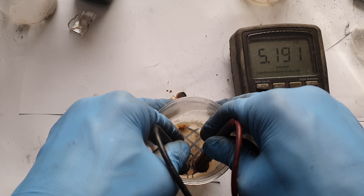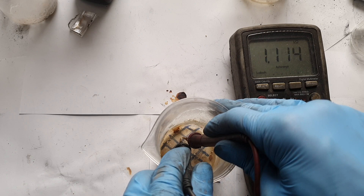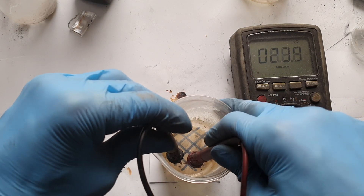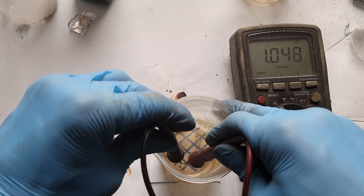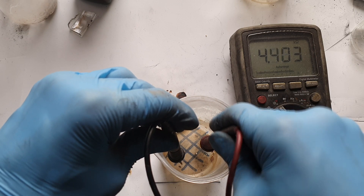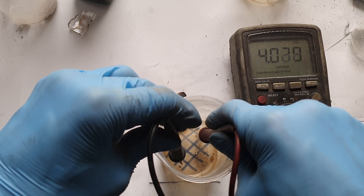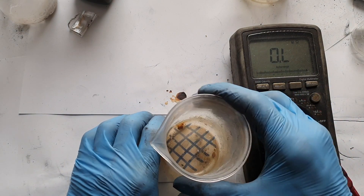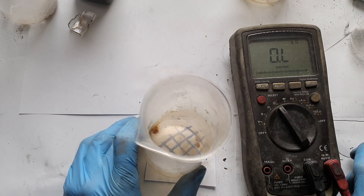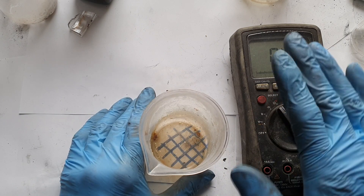Here I get 54 — the coating is not even at all. Here I get 5 kilo ohms, 1 kilo ohm, 1 kilo ohm, 4 kilo ohms on a slightly greater distance, 4 kilo ohms. Like I said, I sprayed the tin chloride solution five times. If I apply a little bit more layers I will get better conductivity, but for now that's it.